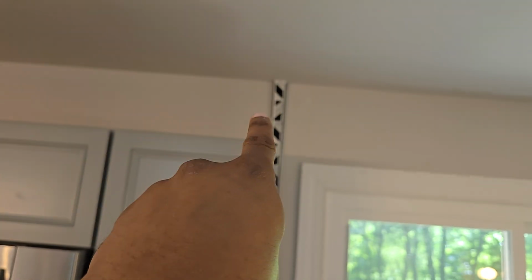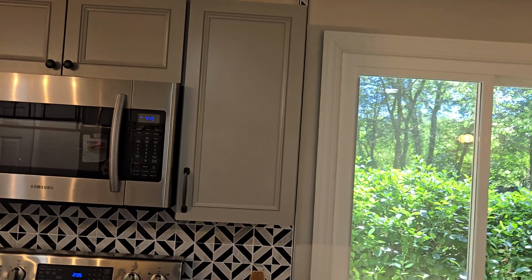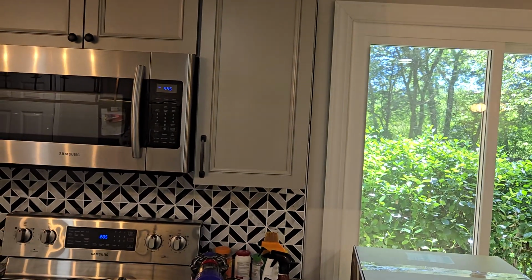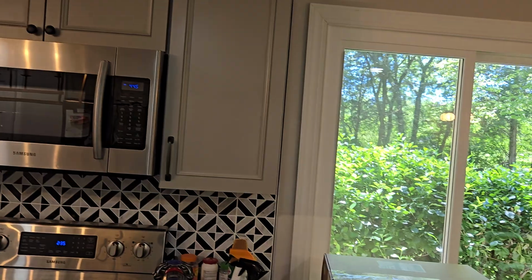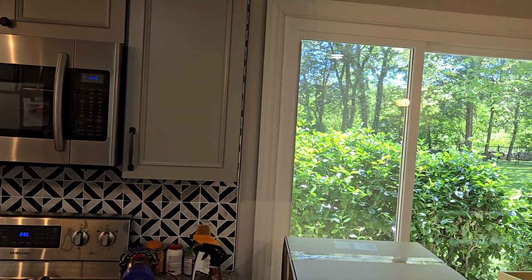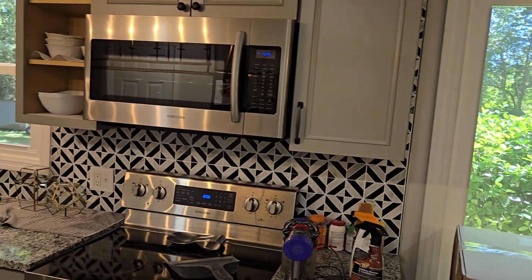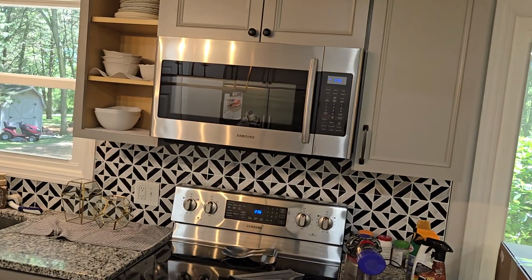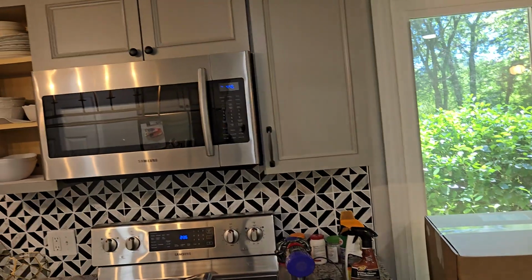One is going to be this area right here. That is a 1.5 inch wide backsplash portion, where the crown molding more than likely will end up being over that 1.5 inch wide backsplash portion. An option for the installers may be to notch out 1.5 inches on site from the crown molding in order to install that crown molding flat against the walls. But again, please do check with our installers prior to promising that to see if that is actually going to be a possibility. The rest of the crown molding will just die into the tile, just as you see, just into the regular walls. It is only this 1.5 inch area which does cause a little bit of concern there.